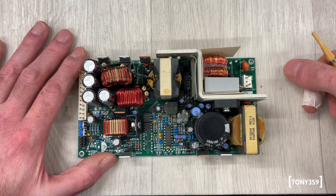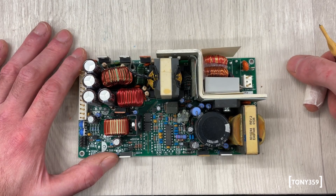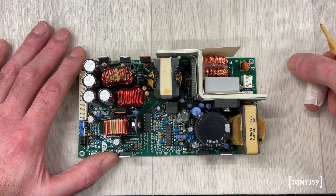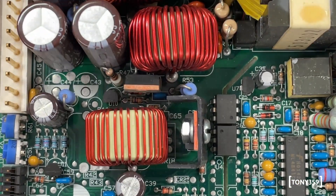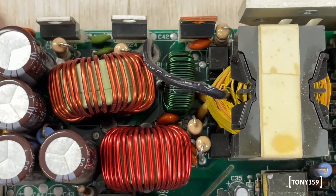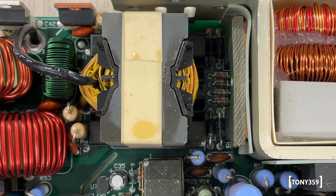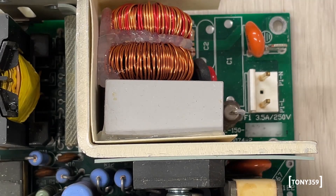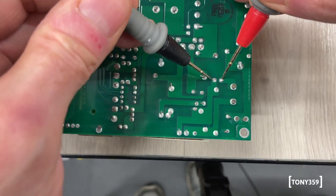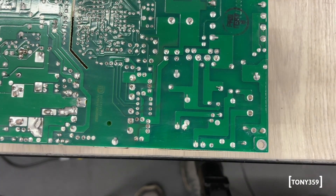The first thing I'd like to do is a quick visual inspection to make sure nothing has exploded, cracked, or burned. If I can't see anything, I'll have to power it up and see what's wrong with it. Looking at this thing, I don't really see anything obvious — nothing burned, split, or cracked. I can check the fuse and see whether it's actually working or not. The fuse is working and looking at the back there's nothing wrong.